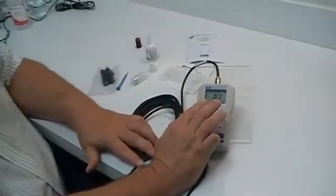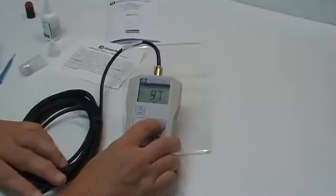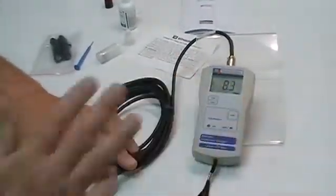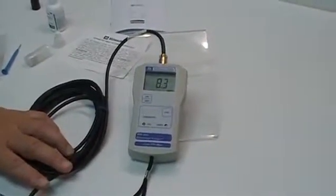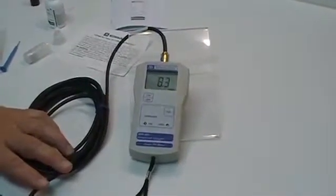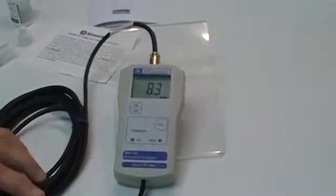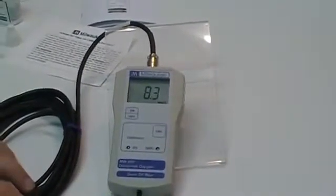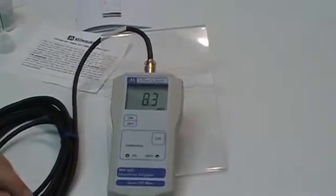As you can see, it's dropping a little bit, because that electrolyte is still being charged. If you press the button again, you'll notice it's dropped from 100 down to 99. This is the reason why you would want to wait 5 to 10 minutes for this unit to finally settle in before you do the 100% calibration. With that, this concludes the open air calibration procedure for the MW600 dissolved oxygen meter. Thank you for choosing Milwaukee Instruments.